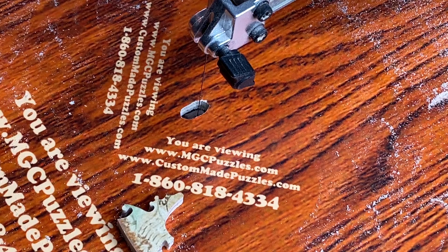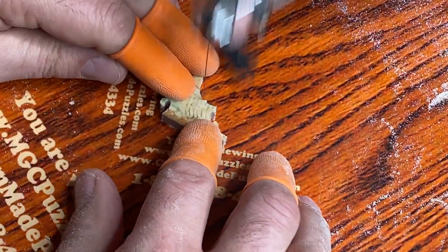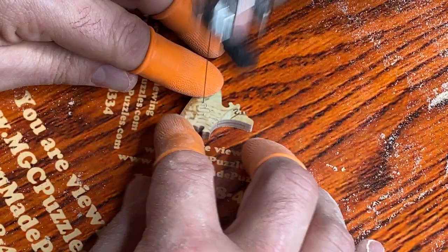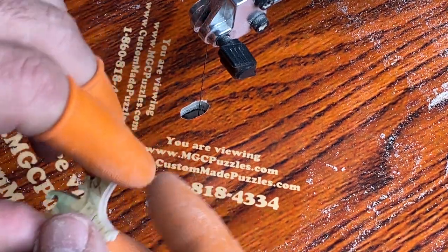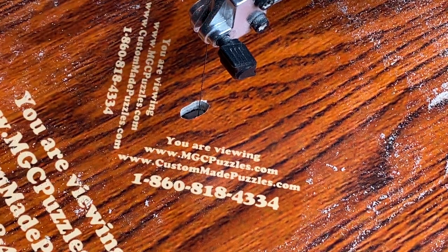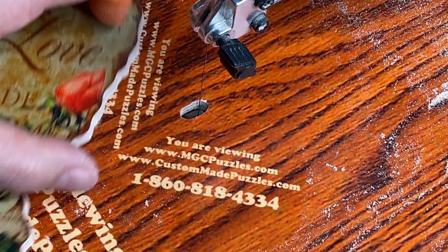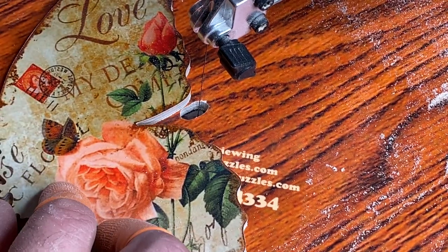And this is definitely not a cool thing when you're cutting a very large puzzle, especially with many hundreds, if not thousands of pieces, to come across an area that's perhaps 2 inch by 2 inch or 5 centimeter by 5 centimeters in size, where suddenly your puzzle pieces are just disintegrating because there's an inner layer completely missing. And with Finland birch, although I have run across that, I have run across it significantly less frequently than when I used to cut birch or Baltic birch myself.